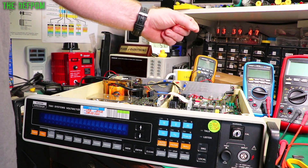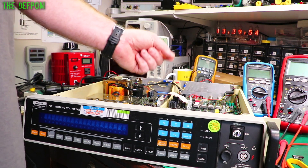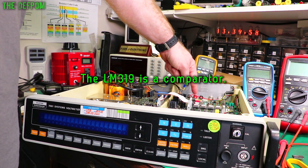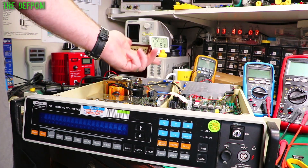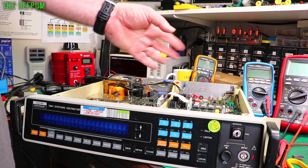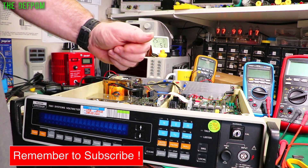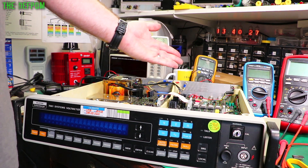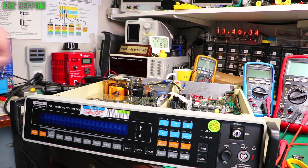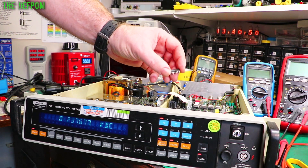What I've done is put the original chip back in again, because the meter was giving an ADC fail message. The integrator is a main part of the ADC — it drives the LM319 op-amp at the back, which then forms the plus and minus glitch pulses decoded by the dual-slope circuitry to determine the voltage. It's a time-ratio measurement. So I swapped the original chip back in. Watch this — it's working! So the LTC1052 chip I installed died after just one day.